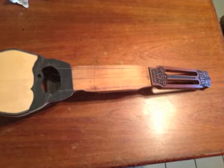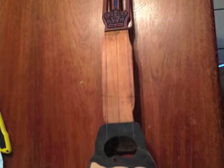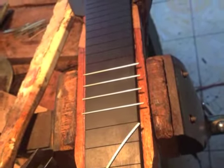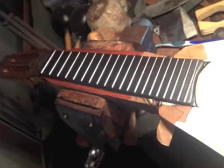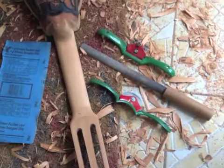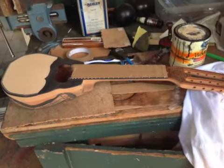The next step will be to glue the fretboard. It will be measured, tapered, cut, then glued onto the neck. The fret slots will be cut out, the frets will be hammered in place, and they will be dressed so that the edges are nicely rounded. The frets have to be absolutely level. And finally, the neck was carved using rasps, draw knives, and sandpaper.